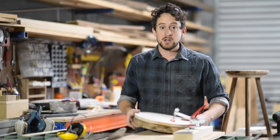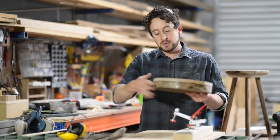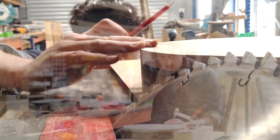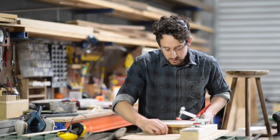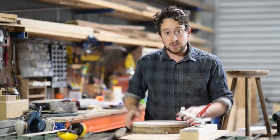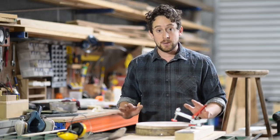I've angled the blade to 45 degrees. I've moved the pivot point so that the blade intersects this face at the point I want it to touch. That's just a matter of lining it up, looking down the line of the blade, and seeing where it's going to intersect that face. Then I put my nail point in — I need a center point drilled in the piece — it sits on that nail and spins. That's going to give me a really nice clean chamfer the whole way around, and with a little bit of sanding it'll come up beautifully.